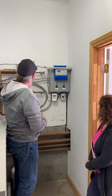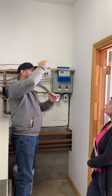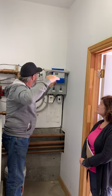So by just pushing that, we just tested this sensor outside. Yep. You've got an outdoor air temperature sensor. You just checked that. So when this thing is operating, if it's below factory settings, and we can check them, if it's below 38 degrees outside and warmer than 10, 38 is warm weather shutdown. So if it's above 38, it's on warm weather shutdown. If it falls below 10 degrees outside at night, it's on cold weather shutdown.